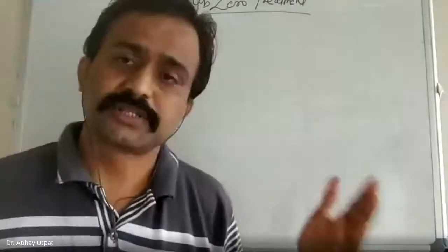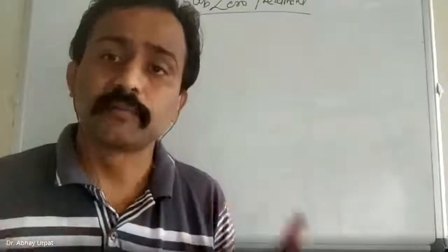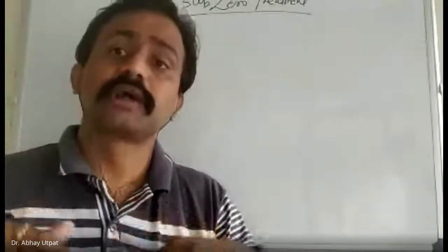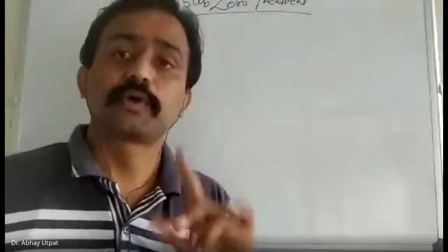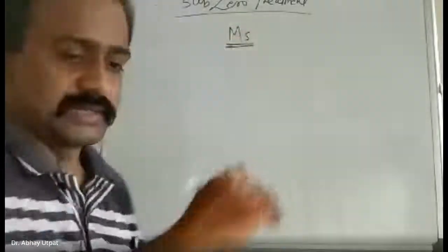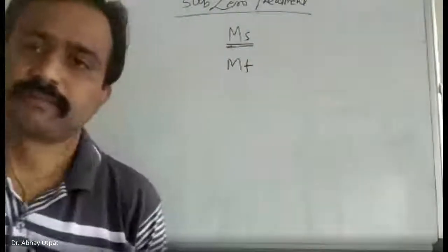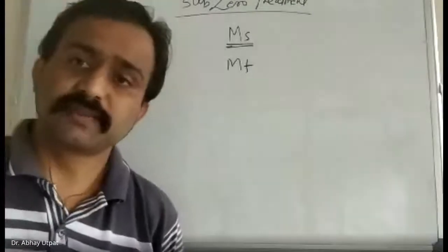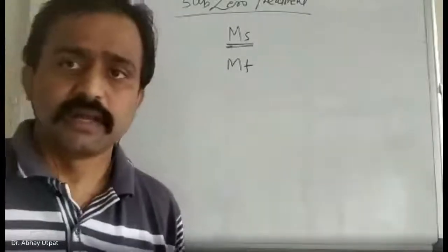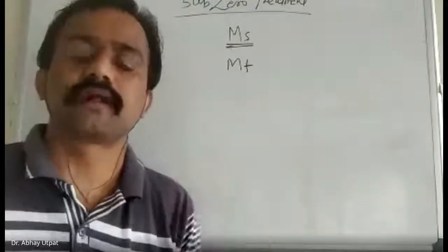On one hand, I am saying that if you cool to lower and lower temperature, chances of distortion and cracking are more. But on the other hand, if you go on cooling to lower and lower temperature, you will get maximum martensite. Why? Because it depends upon the MF temperature. MS temperature is martensite start temperature, and MF temperature is martensite finish temperature. PS means pearlite start, PF pearlite finish, BS bainite start, BF bainite finish. Until and unless your steel crosses that F, F standing for finish temperature, you'll never get 100% amount.